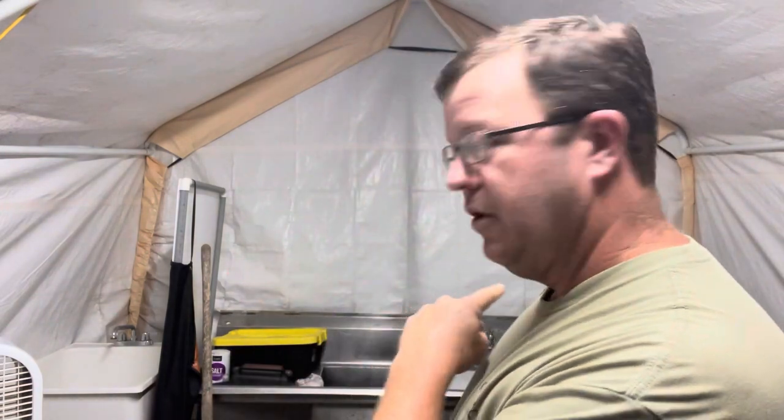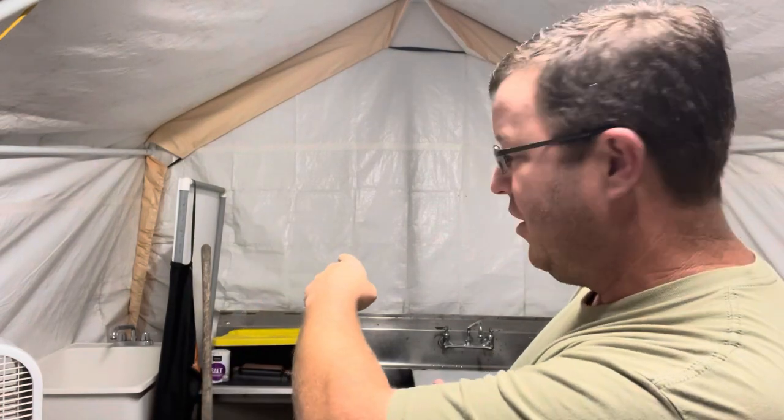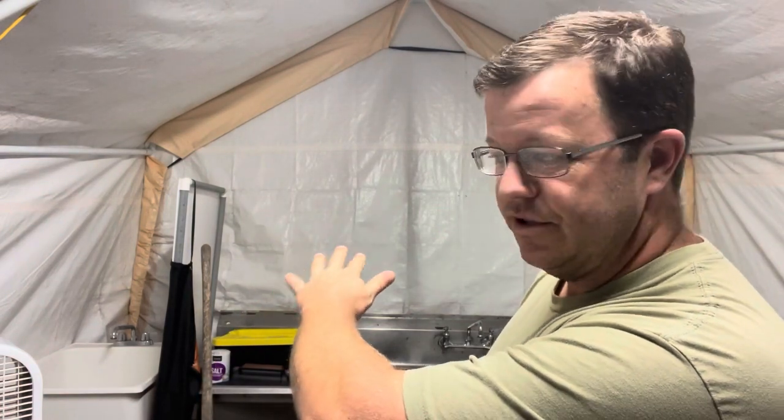So: drainable floor, building, 3-compartment sink, hand washing sink, barrier for no contamination, which you can do away with if you separate them, but I was trying to keep it simple and keep all my plumbing together. Plumbing drain, gray water runs out into the pasture, into a pit, gravel, and then covered back up, and then a bathroom. Oh, and the hot water, I'm sorry. Those were the things that got us approved to do this where we are right now.